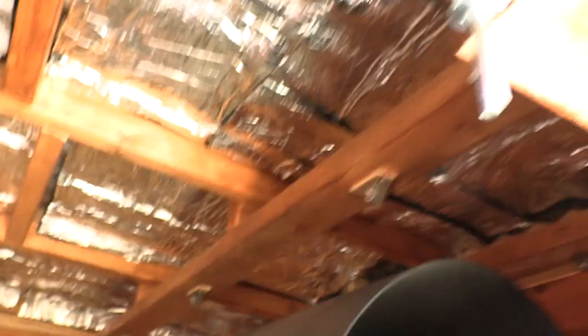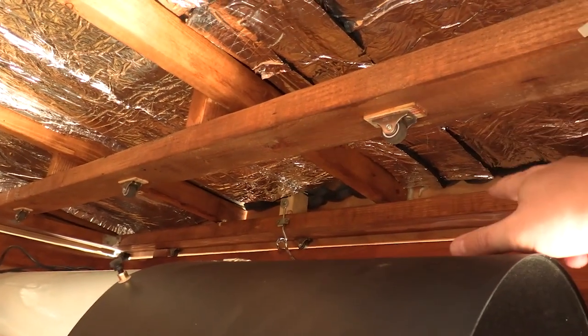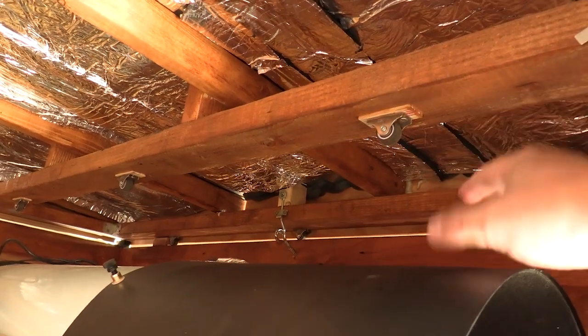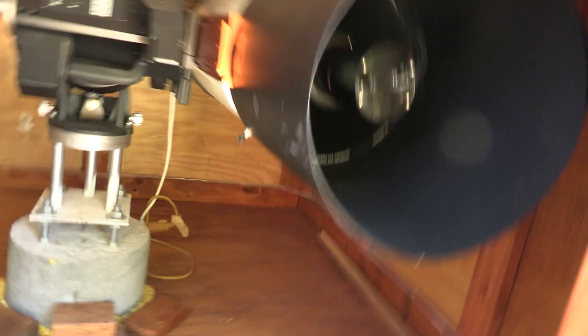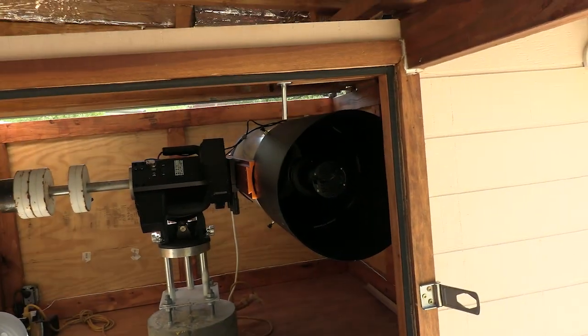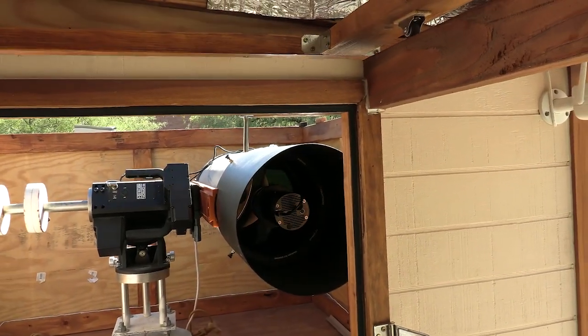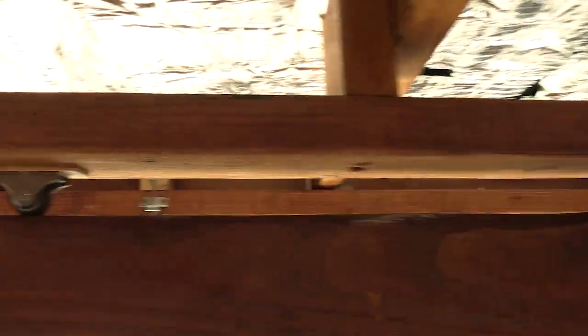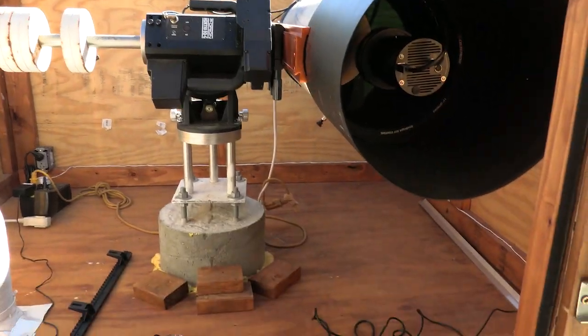There's a locking mechanism for the roof which helps keep it locked in place. When I want to open, I pull that down. The roof itself has the typical roll-off roof rails with wheels, but in this case the rail was offset, so I had to put a secondary rail on the inside here. There are wheels along that wall as well, so as it opens it transfers the weight load from the wall to this inset rail, which avoided blocking the walkway. It takes very little effort to open — just a light tug with a couple of fingers. Now the telescope is exposed to the outside world, and that's the idea.